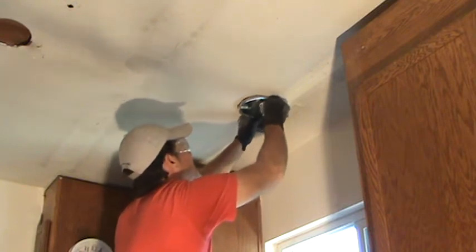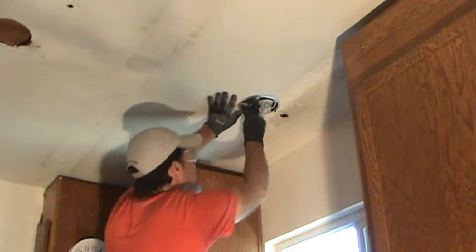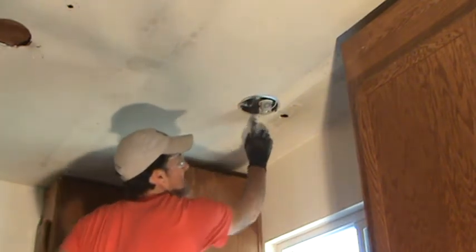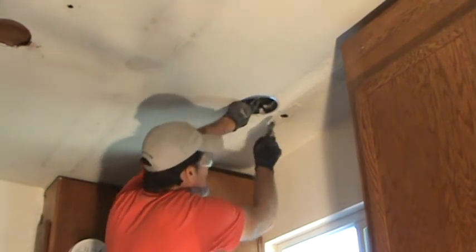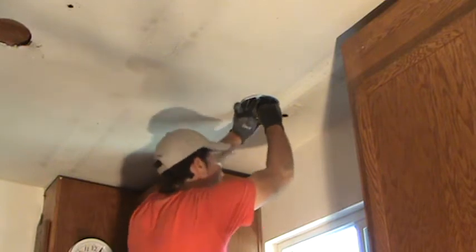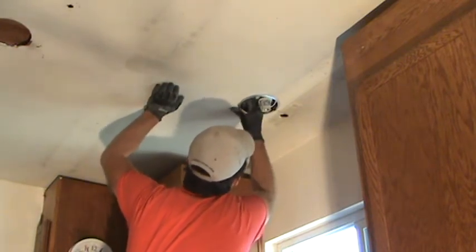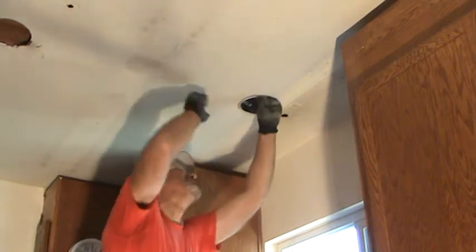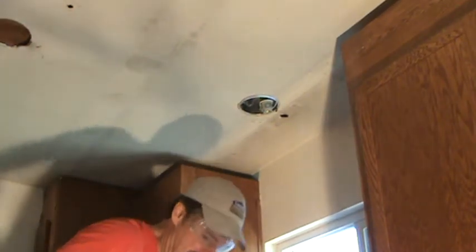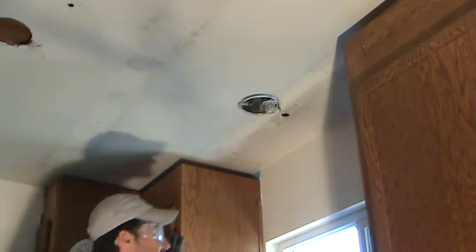So far so good. If you can't get it up there all the way, you can always lower it back down and trim the hole a little bit. There's a little friction pad on the outside. I pushed it up and it's up in there. Now I've got those tabs — remember the tabs — and I'm going to push it hard down, and that kind of wedges down on top of the sheetrock. That's what holds it. There it is, easy breezy.